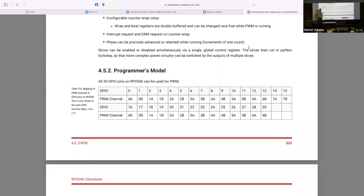For a PWM signal, there are two degrees of freedom we care about: period and duty cycle. You set up the period once and it never changes, by configuring the clock divider and wrap value such that the counting variable wraps 1,000 times a second. We're going to control these motors at a kilohertz. The duty cycle is your control input — in this example the user enters a value, but ultimately in lab three that will be a number computed via a PID controller.